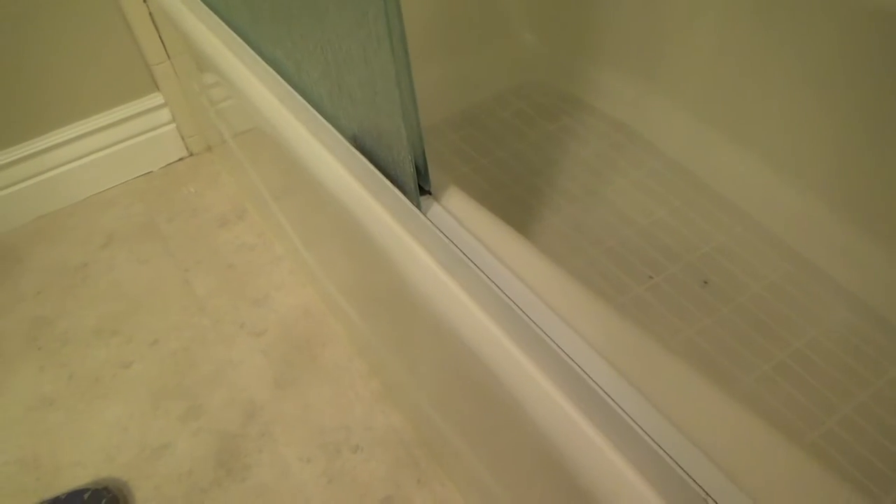But because the tub is almond, I'm going to go along the bottom. You see how it's looking a little tired? I'm going to go along the bottom and caulk that too. And anywhere like right in here, it doesn't look like the grout is cracked or anything, but it looks like it's indented a little bit further than some of the other grout lines. See how this tile here looks a little dark along the edges - that's because you see just a little edge of the tile, and it makes it look black or a darker color.